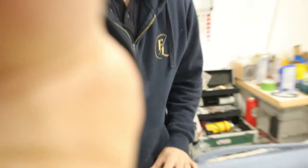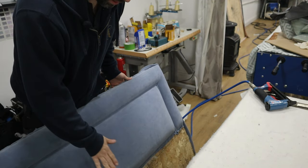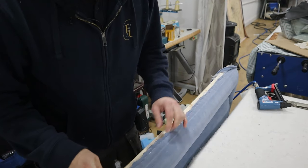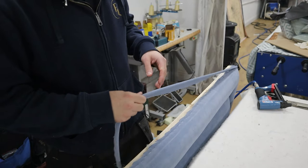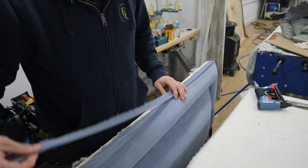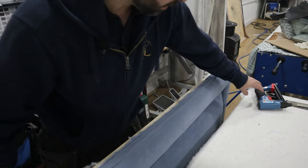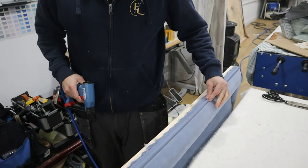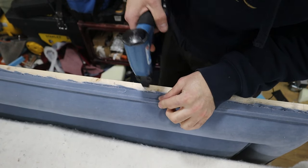We are nearing the end. I've just laid it down here — you can see the middle panel and the border are all on. I've got a bit of chalk and I'll just run it around on top so you can see a faint white line. That is the beginning of the wood frame. So what I'm going to do is go around stapling this piping, then put another board around it just to finish it off with a nice clean finish. I like to run my fingers along the piping to straighten it out. I've got the edge of the piping hitting the white chalk line.